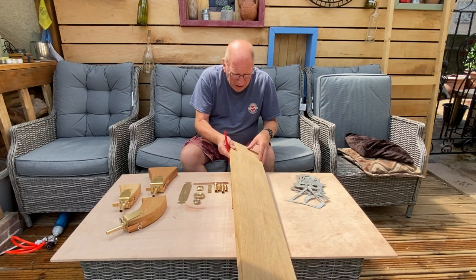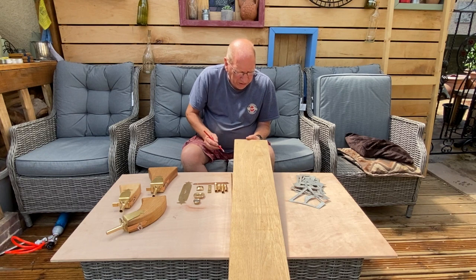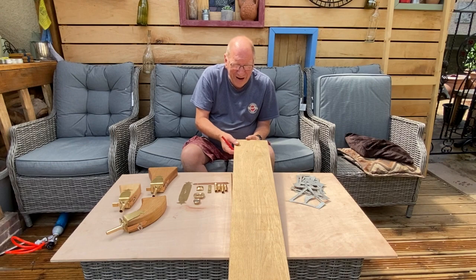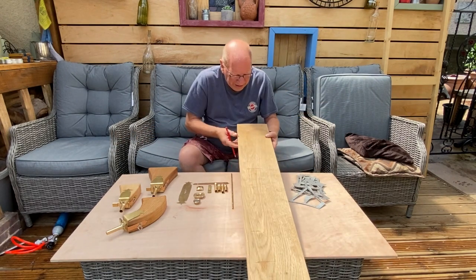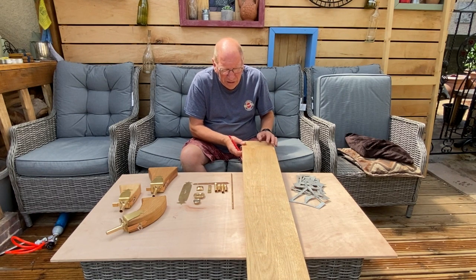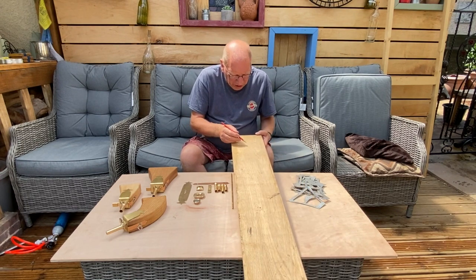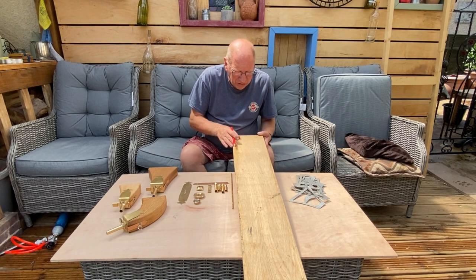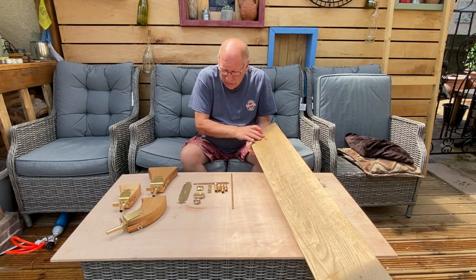Because you're doing the powder flask in two halves, if it's 20mm thick the finished product will be around 40mm, and if it's 25mm that's going to be 50mm thick — which is quite a thick flask. Around 22mm is probably ideal. When you get your piece of wood you need to look for cracks and avoid those areas. Also look at both sides for the best grain — the side with the best grain goes on the outside.